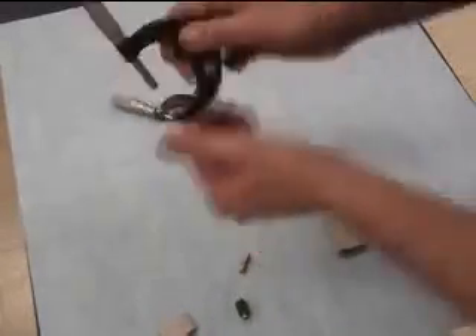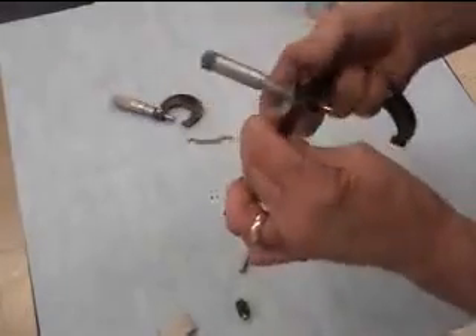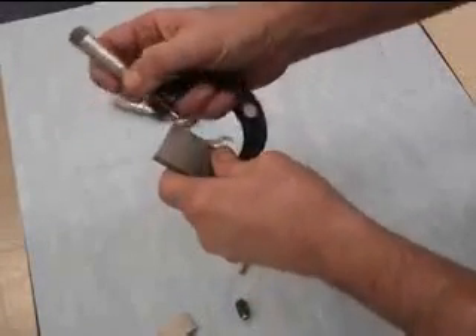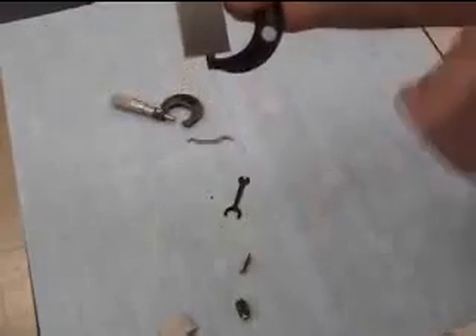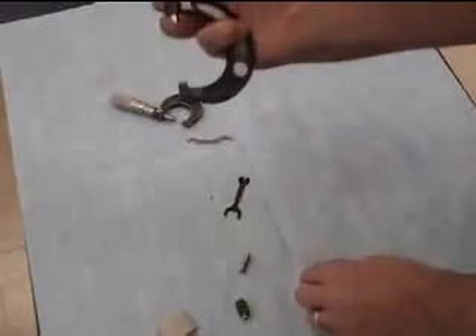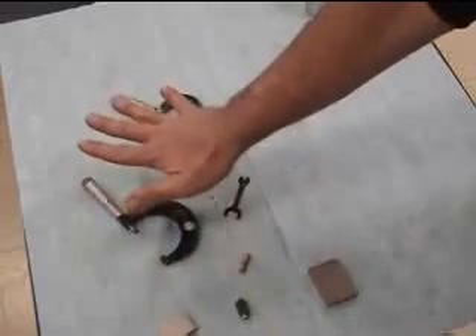Then I need to check it all the way open. I'm going to use my forearm or palm to open it up a little further than one inch. We're going to close it down on two inches — it's a one-to-two inch mic, so we call it a two-inch mic. The reference line is lined up with zero on the thimble, so that is good. This micrometer is now calibrated and ready to be used. But don't ever pick one up out of the tool room and assume it's ready to go, because someone may have dropped it or knocked it out of calibration and just stuck it back in the box. So anytime you use it, make sure you calibrate it first.